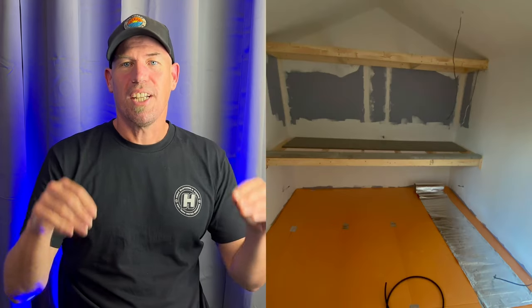To make the room sound nice inside I fitted a classic studio rug and made a few frames out of wood filled with Rockwool to reduce reverb levels. I made a couple of bass traps in the corners where my monitors would be — again with Rockwool and fabric on the outside — and then fitted 100mm of acoustic foam behind my monitoring station to keep frequencies and reverb as flat as possible. I also made a skateboard rack and fitted that in for my skateboarding podcast videos, and gave the music desk a pool skating flavour. The OSB board backing proved really handy — I could put guitar hangers anywhere I wanted and anchor display cabinets and shelves throughout.